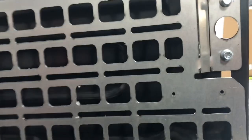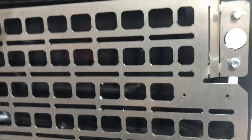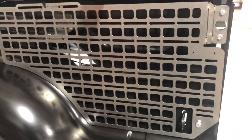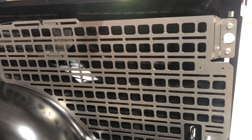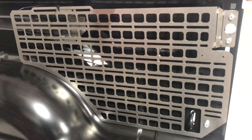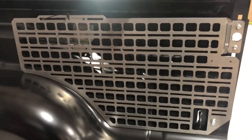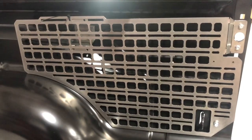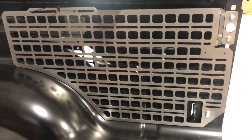What this buys us is that instead of having a unique left and right-hand part, we can use the same part on both sides. That helps me keep a smaller number of SKUs in stock, but the bigger benefit is if you want to swap sides or sell it to somebody that wants an opposite side, that'll be easier. I also finished the design for the front — same kind of deal. I'm going to pull new DXFs, bring them to the table, and cut them out of eighth-inch this time because I'm pretty confident in the design, and we'll mount them up for good.